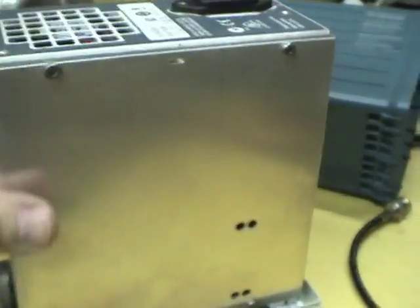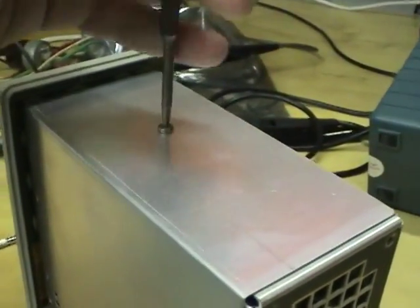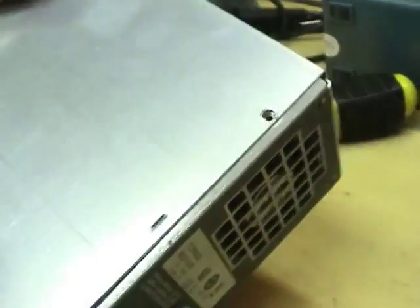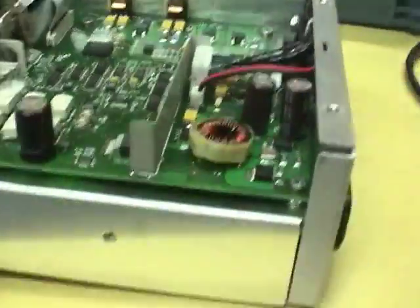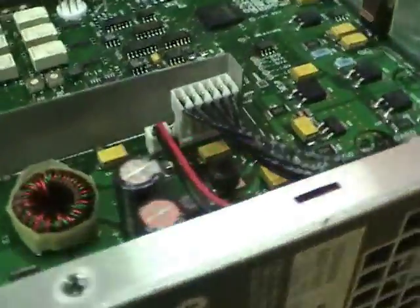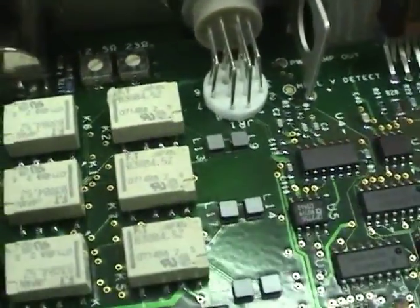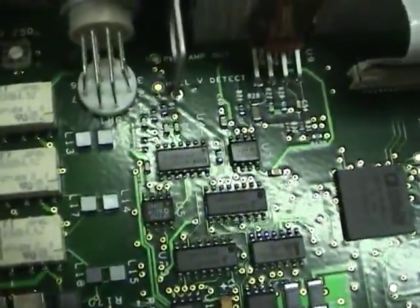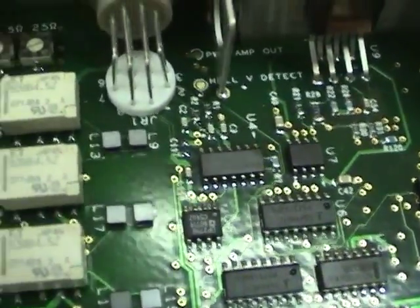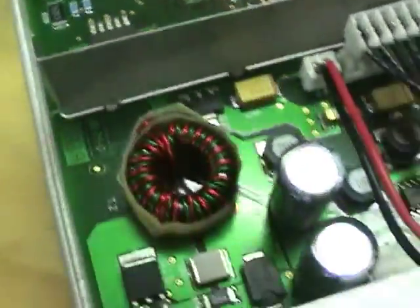And that's some shielding — all shielding. I'll have to take off the cover here. There we go. All just one big board and probably a power supply underneath it. There's the input connection from the connector from the current probe. BNC output. A bunch of relays to switch — probably to switch in coupling and attenuation. Power supply. Various logic. There's some sort of Analog Devices part here. More power supplies and even more power supplies.